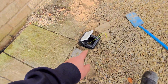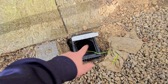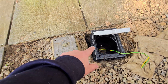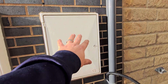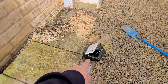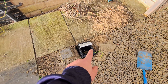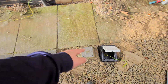It's started raining, so I'll make this quick. Matt's just getting our earth rod in. We've got our earth rod down here — the customer had all plans and pictures from when the services were put in, so we knew we were fine putting the rod in there. This has actually been carved out of a hillside, so technically we're underground before we even started. We've got our copex coming into the box here, and we're going to concrete this in. That's running across under the slab. You can see the PV is actually running up the back of this drain pipe to the loft, so we're going to tie into that to keep it neat into the bottom of the meter cab. There is an earth bar in there, and we're going to join our earth rod into that, so it will sit in parallel for the times we're connected to the grid. When we go off-grid, we've got that earth reference we need for the inverter in island mode. We're just going to get this set back with a bit of concrete, and then we can neaten up the stones around here. This is just a rodding eye which runs out to the drain over there, so we've not gone into anything that way.